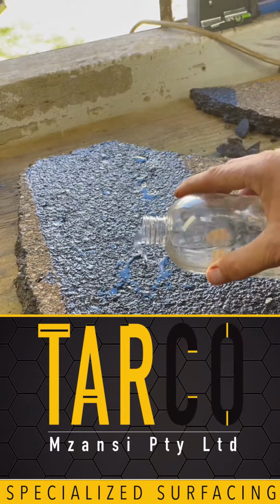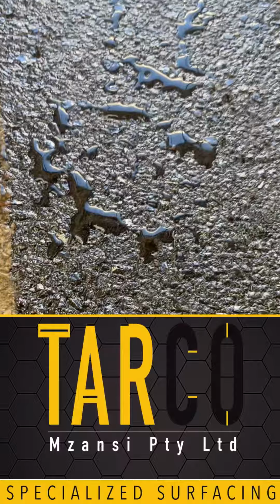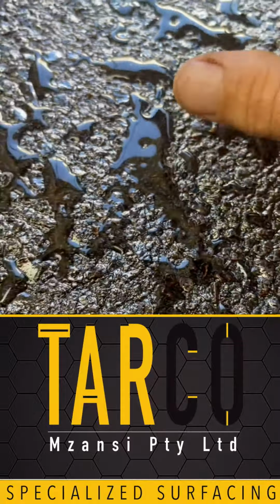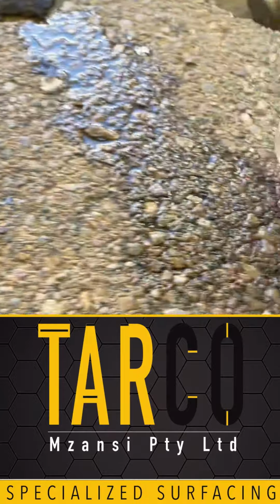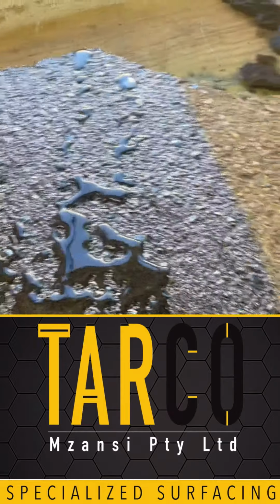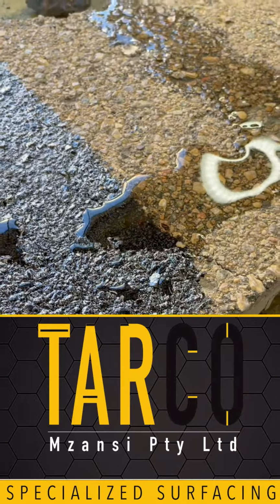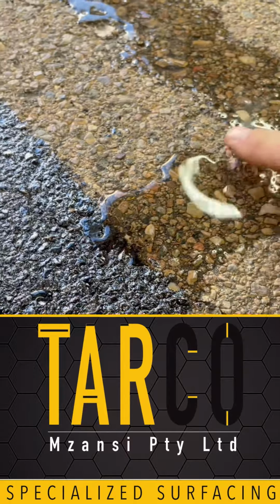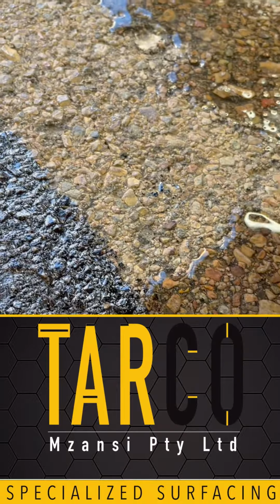On this side, once again, if we add more water, this is the rejuvenated side, obviously. It doesn't penetrate. And any micro cracks in the road would find bitumen like this, and it actually reseals the two surfaces together. Whereas on this side, the water is still going down. Good runoff. Let me show you, if I pour it from the rejuvenated side over onto the other, see how it drains off? And on this one, it's still penetrating. Look at that. Still going down. This will seep through the asphalt surface before it actually finds a way off the road.